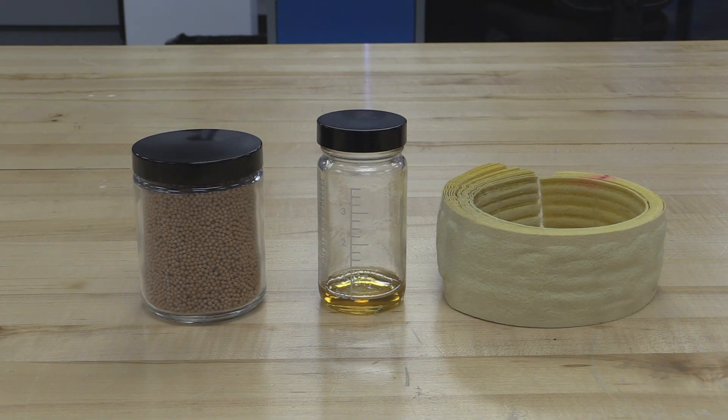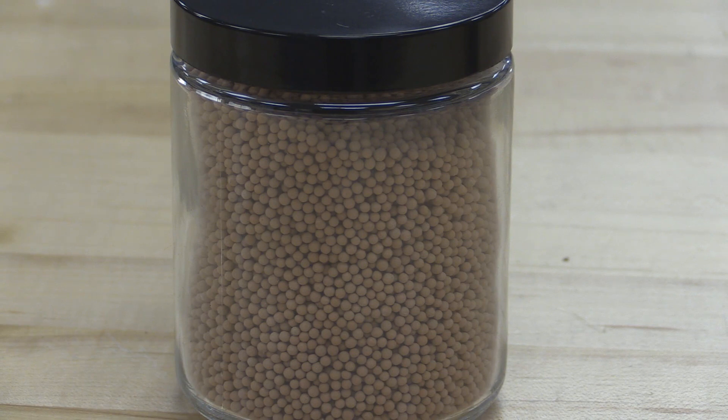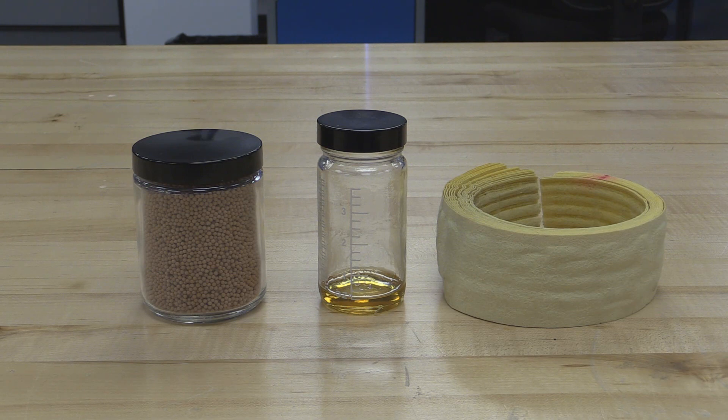Let's take a look at what's inside a dryer cartridge and what happens to it after a few years of operation on a typical truck. These samples are from actual fleets and are from an air dryer cartridge that's been working for about three years — a significant amount of time for one of these spin-on cartridges. To the left you can see the desiccant; it looks like brand new and performs like brand new, because the Pure Guard oil coalescing cartridge has been removing oil from the system and keeping it off the desiccant. In the center is a small amount of oil — effectively the amount that gets passed into the service tanks during this period, which is very small compared to what's actually produced from the compressor. On the right you can see the resultant coalescing filter after several years of service: it's intact and relatively clean, so this cartridge was still performing like a brand new product.